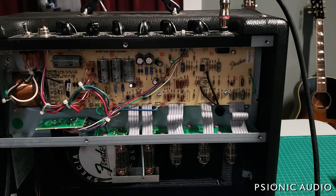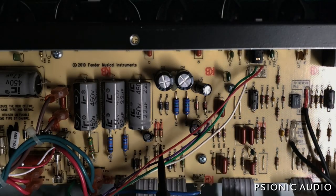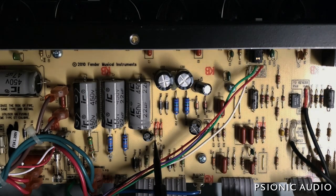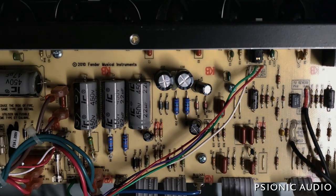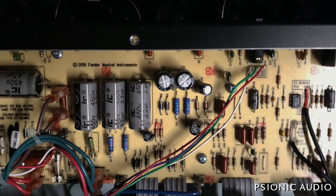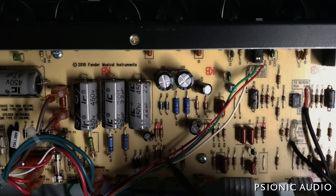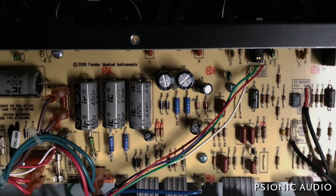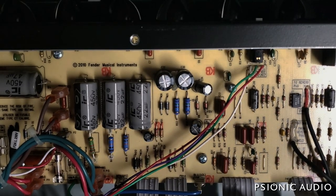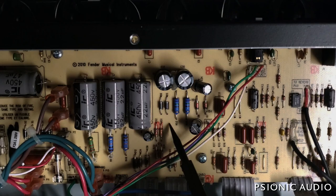I'm going to show this insert bit where I cool off the bias and we'll hear the result. What we're looking for are R51, which is a 33K, and R52, which is a 22K. Those two together make a voltage divider that sets, at their junction, the bias voltage sent to the output tubes. On the first three versions of the Blues Junior, that bias is not negative enough. It's confusing — if it gets more negative, the bias is cooler; if it gets less negative, the bias is hotter. We want to make it more negative and cool off the tubes, moving them from idling at about 90% down to the 50s. Some guys will take out R51 and put an adjustable trim pot there.